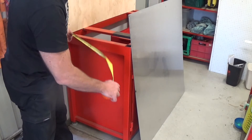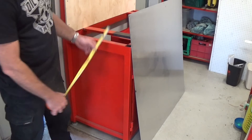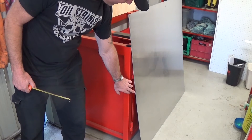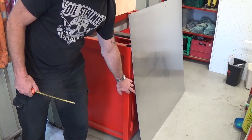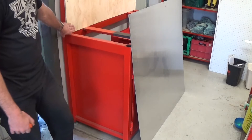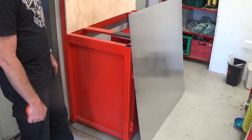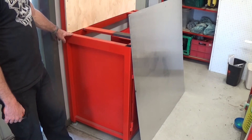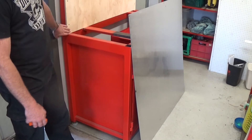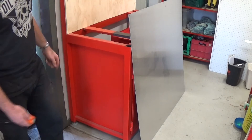I've measured from the edge of the backboard to the front of the table — 587 millimeters. I'll use a sharpie to colour a small section and then scribe exactly on the mark. I was going to put a 45-degree angle in the corner so coolant would run back, but that takes up space and if I don't get the bends right it won't fit. So I'll keep it simple — just a 90-degree bend — giving me an aluminium back and an aluminium tray. Let's head over to the magna bend and fold it up.